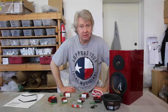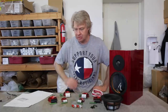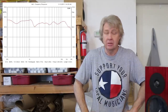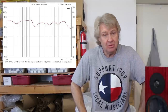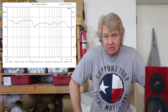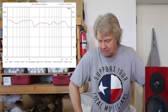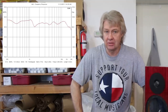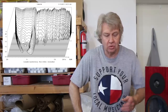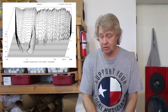Let's take a look at how this thing measured. I first took some on-axis measurements on it — it's within plus or minus a couple of dB, so you might think nice and smooth. But no, not quite. If you look at the frequency response, you'll see a little bit of a crest at about 1,100 Hz, a little bit of a peak there. And if we look at the spectral decay, you'll see it's more than just a little crest or peak — there's some stored energy there in this little woofer, and it's carrying on quite a bit.